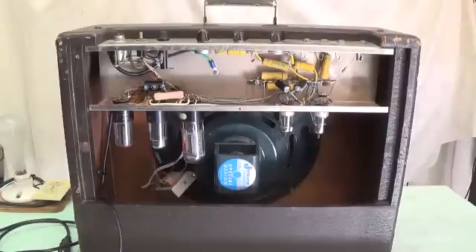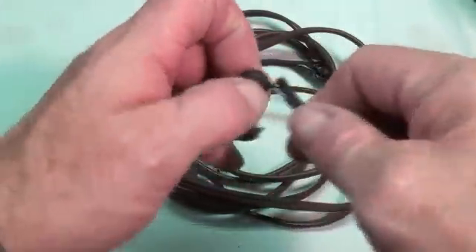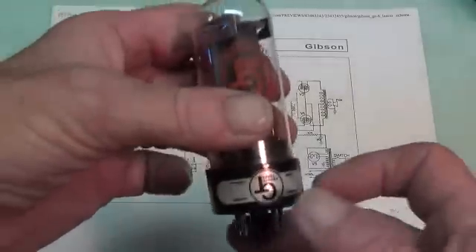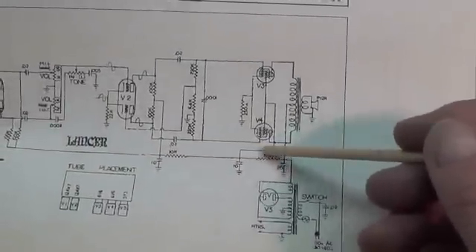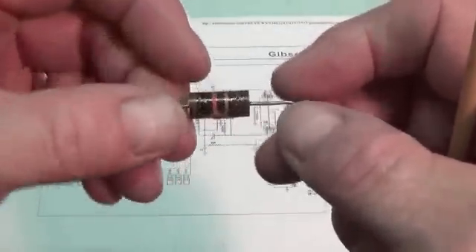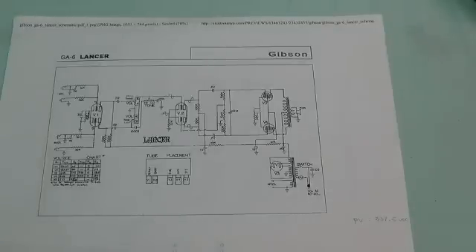It's all fixed. Let's take a few seconds to review how it got that way. First, a decent three-wire grounded power cord instead of the old one. Replacement of the Astron filter capacitors. Then to figure out why it went stone dead, I discovered one of the 6V6 output tubes had developed a dead short between pin 4 and 8, which means the high voltage suddenly had an easy route to ground through the cathode, and it started to really overheat the 10K resistor. Here is the resistor that was in it originally — heat has really gotten to it — and when I put in a larger resistor, you can see it really went up in smoke. So this was the tip-off that helped me find the shorted tube, which I replaced with a nice vintage 6V6, and everything went back to normal.